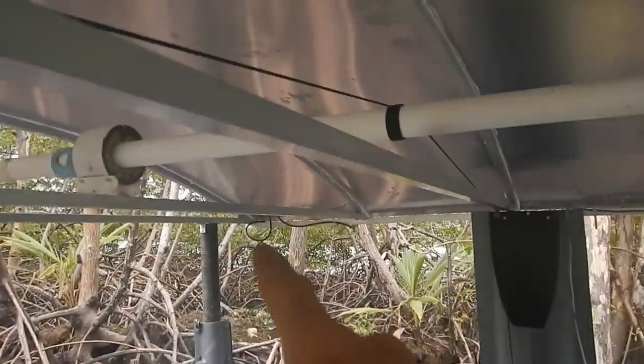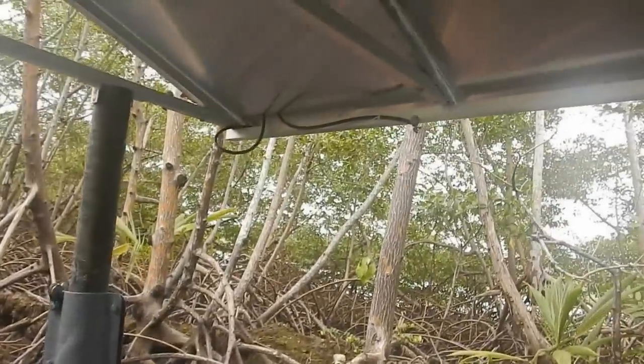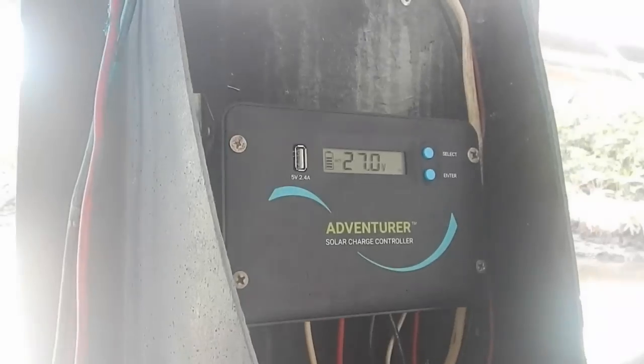That's one panel connected in, and I have another solar panel on the other side I can connect. This wire is going to have to run across here and then come in. I didn't have a long enough piece of double-strand wire so I'll just use two individual wires. Second solar panel is in — looks like it's charging faster now. I just have to wait for one battery to get fully charged, then fully charge the other, then connect them to each other in parallel for an hour or a day to let them level out.